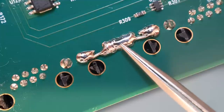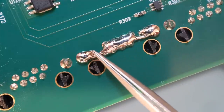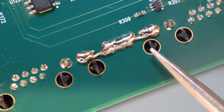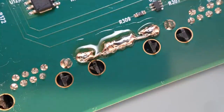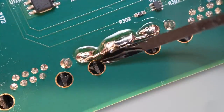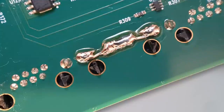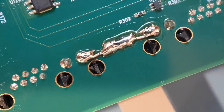All I do now is put a solder joint onto the wire at each end, get all this joined up together, then put my iron on top - the heat will run along the wire, melt all the joints at the same time, and just pull the connector through. As you can see I've soldered the loops either end that go around the can pins, and I've joined all the eight pins together from the external connections. Everything's connected to that tin copper wire. I've added flux and changed to a larger iron tip to get a bit more heat in. I'll put a pair of tweezers just inside the connector to give it a bit of downward leverage.